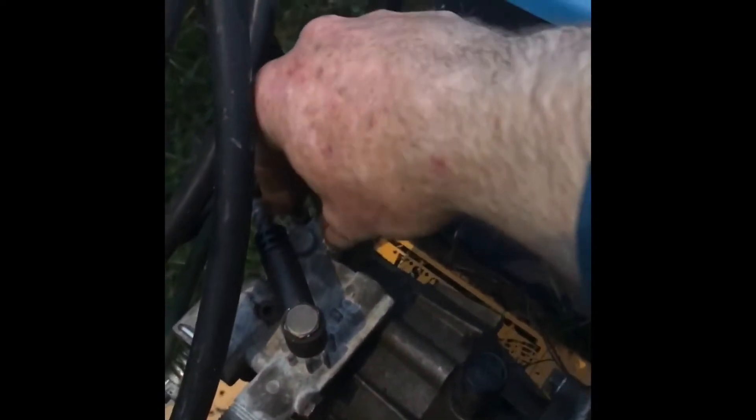This one would not have probably started with just putting the grease in there. I've since put the grease in there, and as you can see looking at that pump, the grease is going to keep this lubricated and keep down that aluminum corrosion that takes place when you just let this thing sit. Whatever kind of lubricant you can get is going to help.